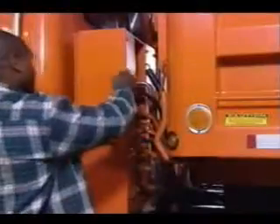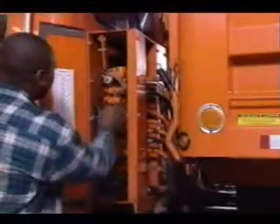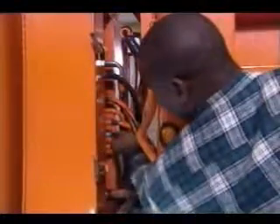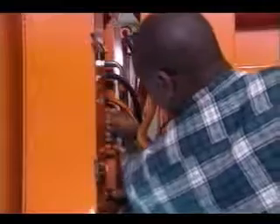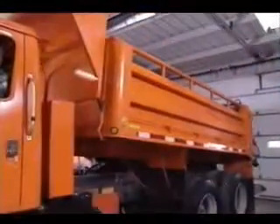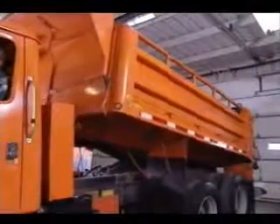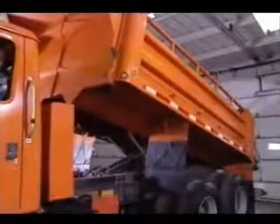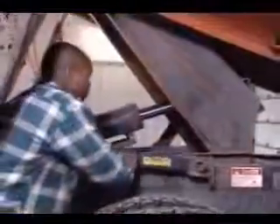That takes care of the tires and wheels. Now, turn your attention to the hydraulic system. There are a number of hydraulic valves and hundreds of feet of hydraulic hoses on the plow truck, so take your time to check all that you can see. Check for oil leaks along each hose and around each fitting. On most trucks, you will want to raise the box to get a good look at many of the hoses and fittings. Once the box is raised, make sure to put the box stops in place, then lower the box onto the stops before you start your inspection.